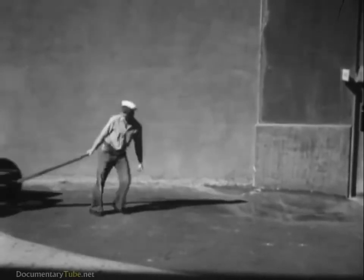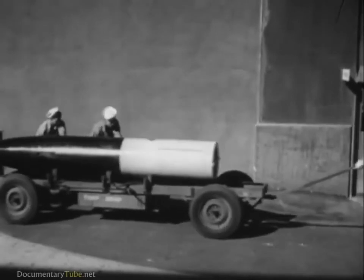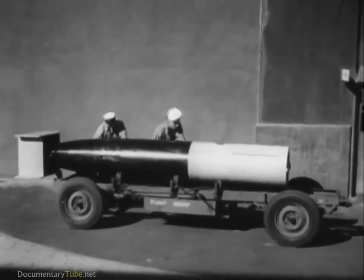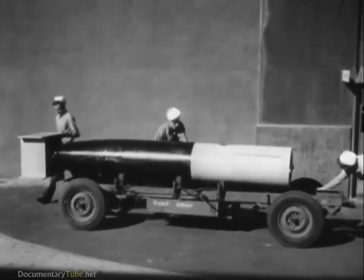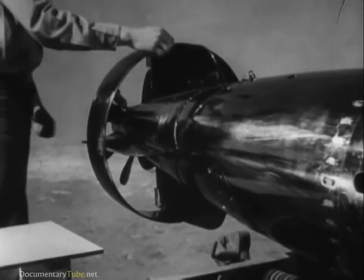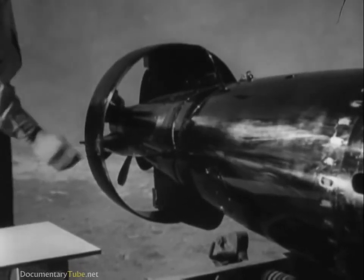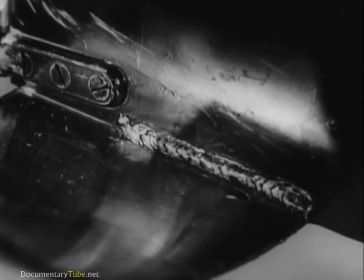All torpedoes of the Mark 13, Mod 6, 7, 8, and 9 type look pretty much like the older models. So what has revolutionized the performance of the torpedo? The shroud ring, commonly called the ring tail, Mark 1, Model 0, in conjunction with a drag ring on the nose of the torpedo, does the trick. This is a steel ring welded to guide vanes of the new torpedo.